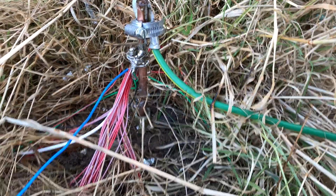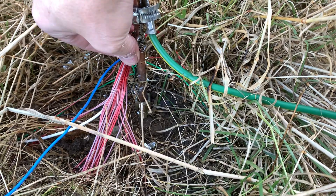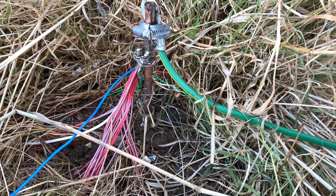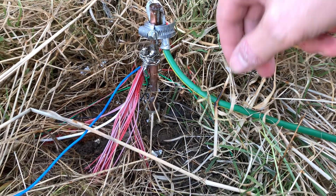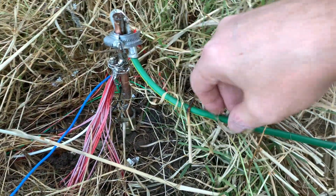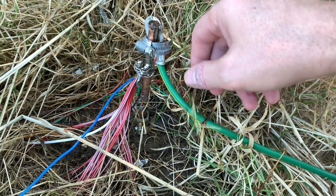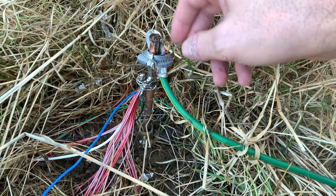With 18 months of weathering and oxidization, I feel I've now got a much better connection from the earth rod to the radials. The earthing to the transformer I've managed to clamp — I've cleaned the rod and clamped it with a jubilee clip, and actually managed to get some solder to run there as well.